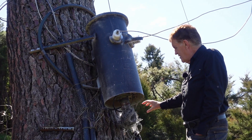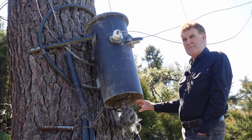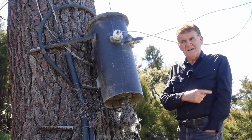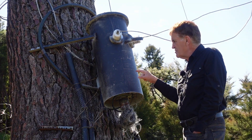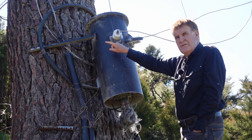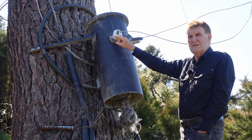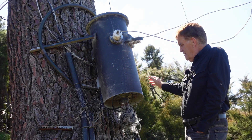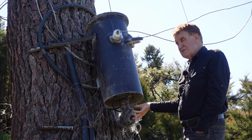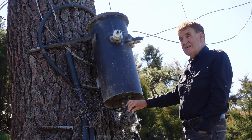At the bottom here we've got 50 millimeter — or two inch — black polythene pipe which goes down to the house, so there's plenty of room for putting more cables through. The cable that comes out of that is about the size of RG213 — it's actually Heliax cable, but it's about the size of RG213. That comes into the base here, which is 50 ohm.